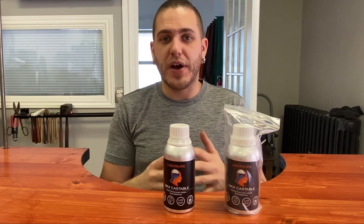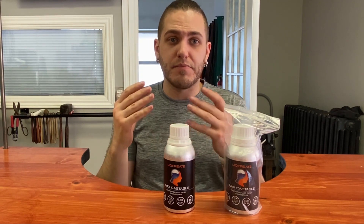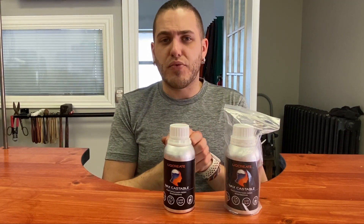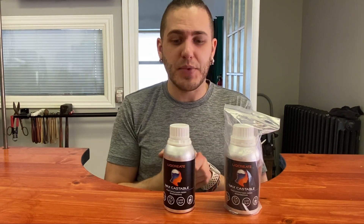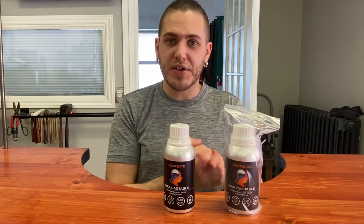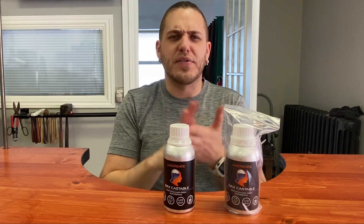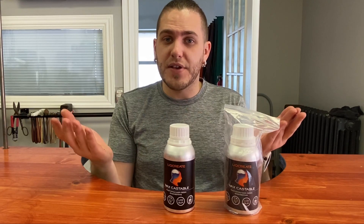Also on their website, it is strongly advised that you work with less than 0.05 millimeter layer heights, which is pretty normal with jewelry since you're aiming for the best possible print and casting. They also state on their website that they use Prestige Uni-Cast investment. I don't have personal experience with that, but as part of our tests we're going to be using R&R Ultra Vest. As per their burnout schedule, it's basically the same as wax, so we're going to test that and see how well it stands up to the burnout process.